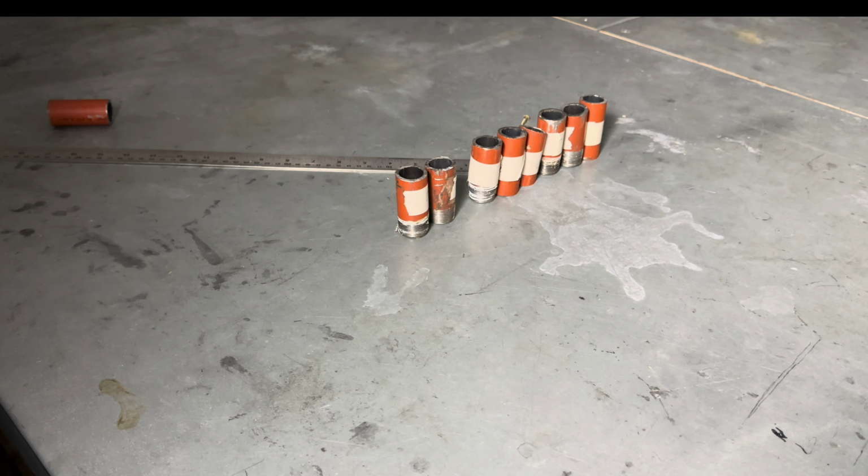And then finally, I check for filing. Okay, so I put my finger inside, outside. If I can cut myself, if I feel any sharpness, it's a fail. So this one here, I'm feeling sharpness. This one here, you can probably just about see it on camera. That'll be eliminated. Okay, that's enough.